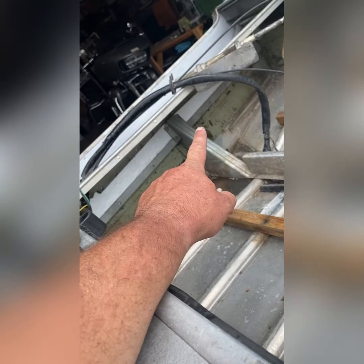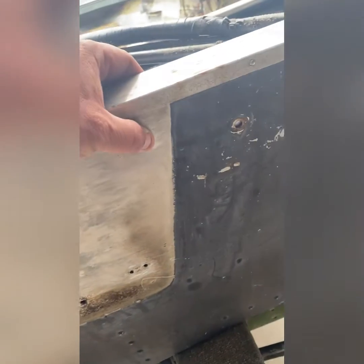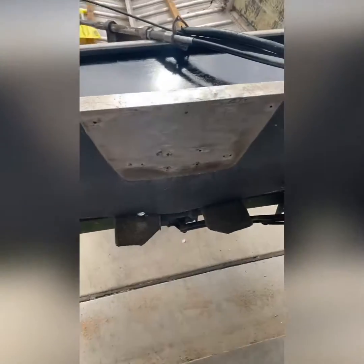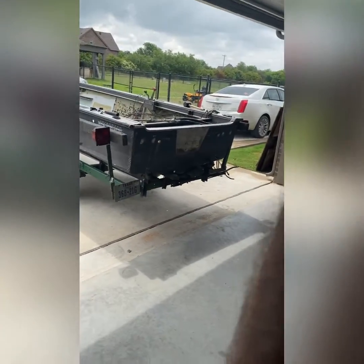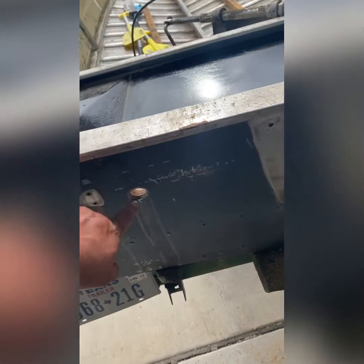It's pretty solid. I just need to — down there where that little trim sits — there are holes that need to be bolted. These four holes actually go all the way through the transom and come out right here. A few others were just screwed on. I think these three here and these four went all the way through. I also have this back piece which is going to be replaced — I just kept it for my pattern. Once I got it set in there, I went ahead and cut my splash well drain holes.